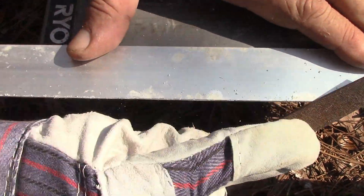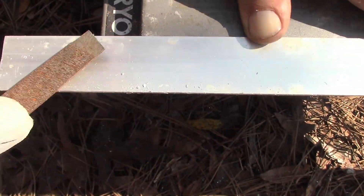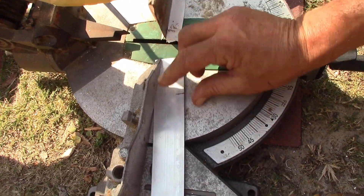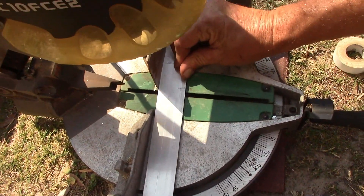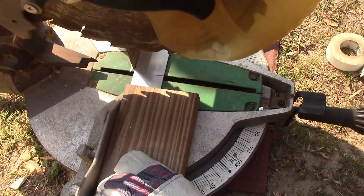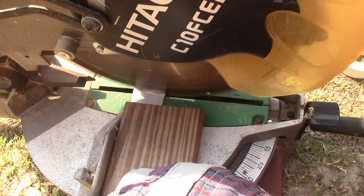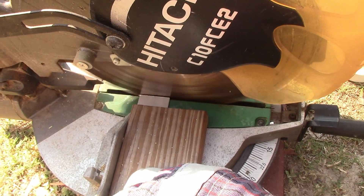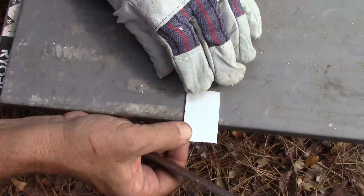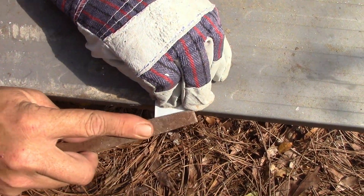Putting the board over that piece of aluminum when you're using the chop saw is a good idea, especially as pieces get smaller — I've seen a lot of people get hurt by doing that. These were all cut to two-inch pieces — an inch and a half wide by two inches. The flange on the panel is one inch and sticks out one inch. I marked them off on the panel, drilled the holes, put a washer on the inside and a lock nut — the lock nut has a little nylon inside that keeps it from backing off.